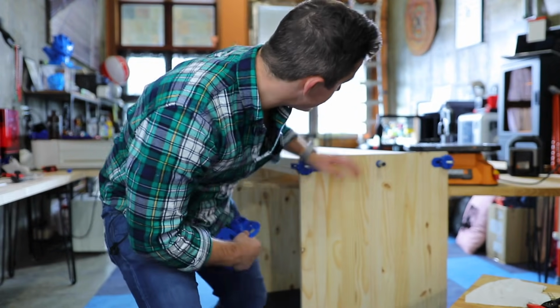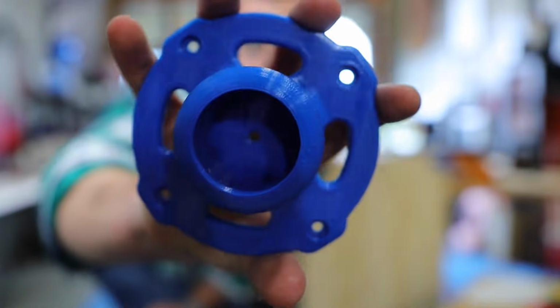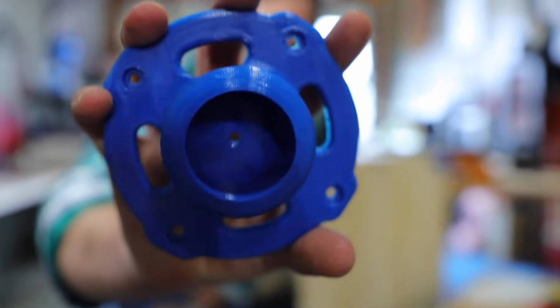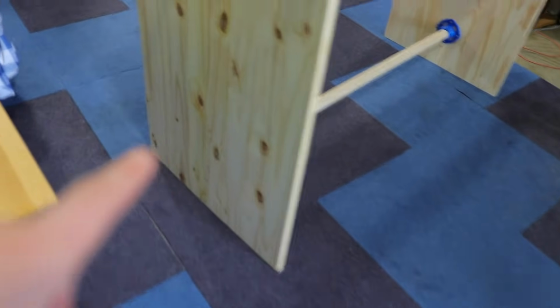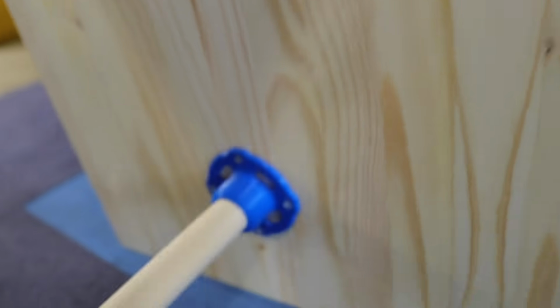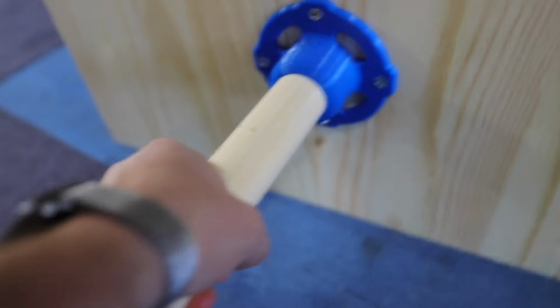As you can tell, this thing is still a little bit wobbly, but I 3D printed another part, and this is gonna hold a 1.5-inch dowel along the bottom of the 2 sides that hopefully gives it a little bit more stability. So let's go ahead and install that now. Okay, the crossbar is in. It screws in on each side, on the outside here, and then on the other side, we've got 4 screws that attach into this bracket that give it a little bit extra stability.